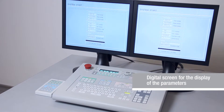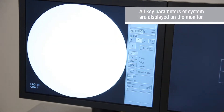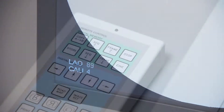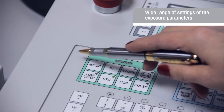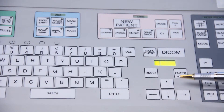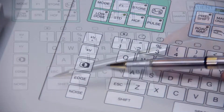The remote control for the whole system is located in the control room. The system has a simple interface for any data entry, and all key parameters are displayed on the monitor: operating mode, frequency of image shots, X-ray tube heating level, and C-arm position. There is a remote infrared mini panel with a control unit for radioscopy, a control unit for angiographic programs, and switching to various modes of image recording. Arrow buttons are provided, and the block for image processing is located on the right. The lower left part handles setting the quality of the images.